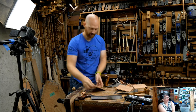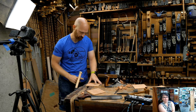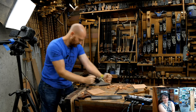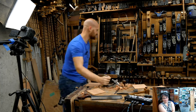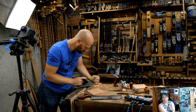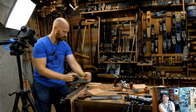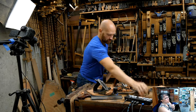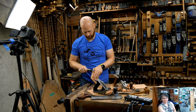3-2, 3-2, 3-1, 3-2. I'll take it. So I want to take all the rest of these down to 0.32. Actually, I think my number 5 is sharp. This will take off a lot more material far faster. So how much are you trying to take off? I don't know yet. I'm going to take it all down to 0.32 inches. This one was the one I had to take off the most material, so I'm going to take it down to that one. So this is currently at 0.34.